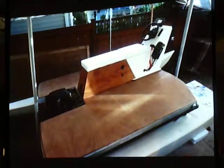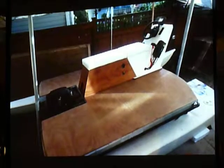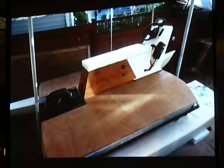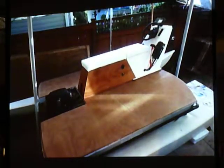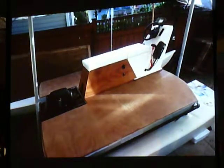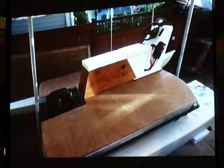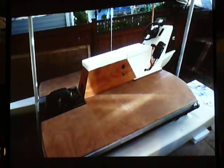And actually, my first thought was that I would just reverse the motor in order to reverse the direction, so if you want to back up. But you can't reverse this motor, it would just kick the gear shift. And apparently that's typical of outboard motors. So you actually do have to physically shift the motor into gear, and going forward or going backwards is putting the motor into forward in both cases. Apparently what they do is the gears will handle reverse. They're not as strong or as well manufactured as the gears that handle forward. Right. They keep the motor lighter, they keep their cost down. And I think it's something to do with when you are coasting, the propeller will turn, so it's skipping as if it was going in reverse. So it's not acting as a brake when you let the power off.